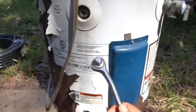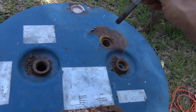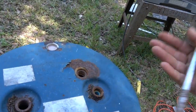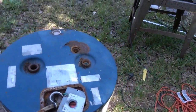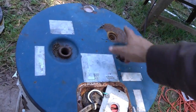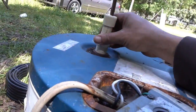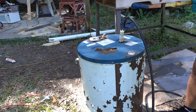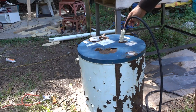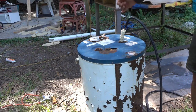The ratchet that fits in there nicely — it did that to it. So these, over time — if the anode rod, which goes in here and which is what we're going to be using, goes bad — the one I had is completely just a little wire left — that stuff will actually start to get really bad, so you don't want to let them get like this. This tank still seals, so we're going to be using it for testing. The way this goes, it would just drop into one of the holes and tighten down, and you've got this inside. Then what you would do is put fuel line hose that fits over there with a clamp — you're in and you're out, it doesn't really matter which direction you go — and your heated fluid would run through that and transfer it to the water.